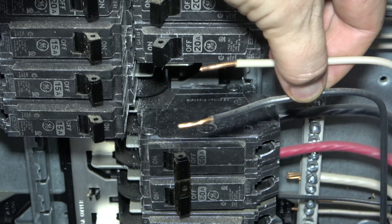Note that both of these wires are used to carry 120 volts each. The white is used as a hot just like the black wire. It may be code in your area to label the white wire with a piece of black electrical tape.